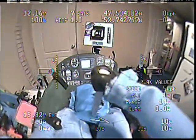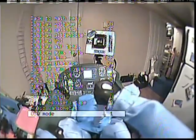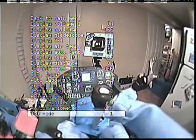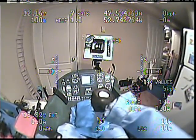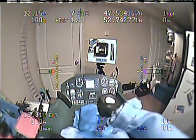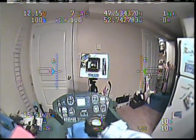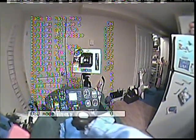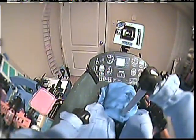Also, I have a three-position switch on my Taranis to go through the three menus — the menu, then to fly, and the autopilot, which is basically returning home. But with the Dragon OSD there are actually four positions. So what I need to do is go in and slave a channel and an open switch for the fourth position to be able to turn off the menu — or turn off the OSD — like so.